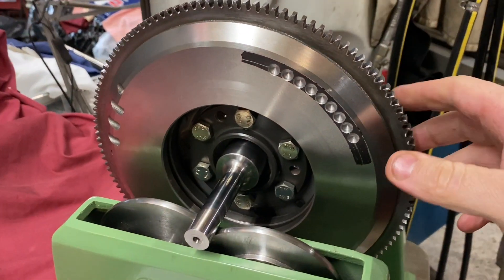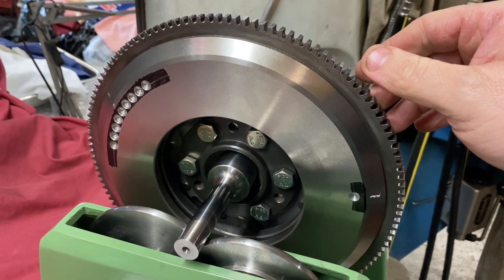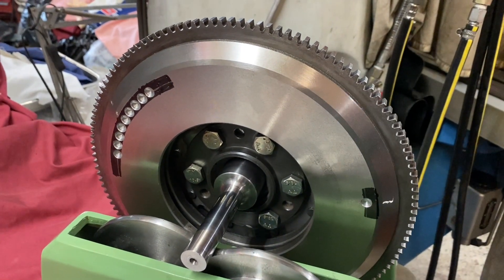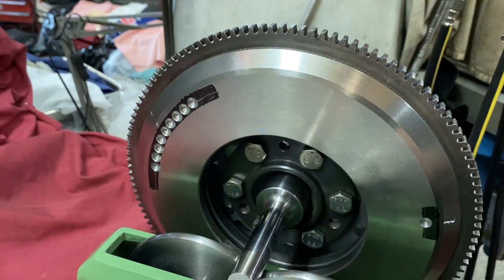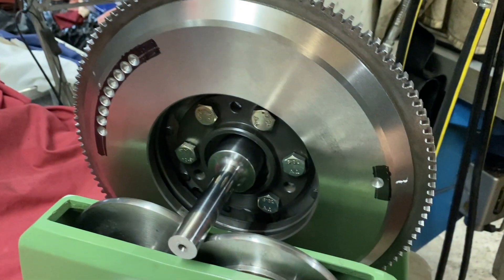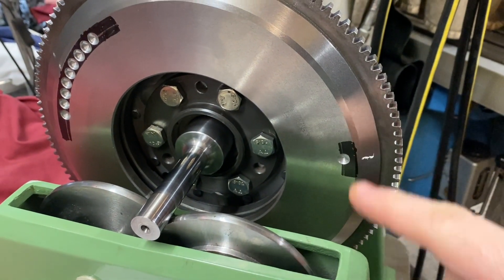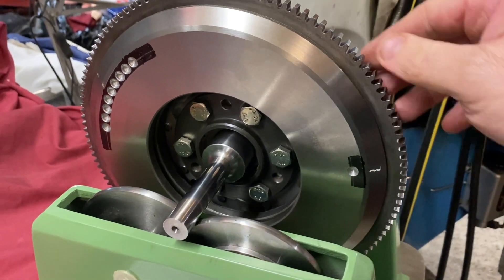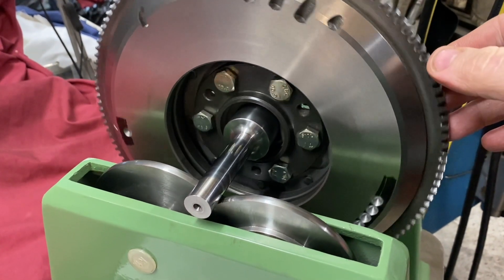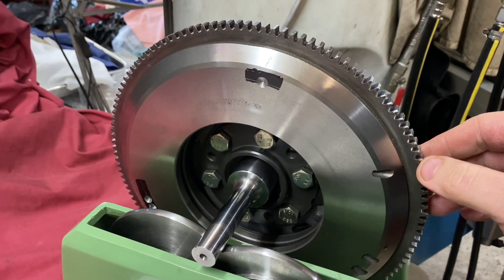We're drilled into balance. This is a good example to show you what happens when you just over drill — as you can see, I've got the holes here to get it in and actually that's a little bit too much. So I just had to drill an extra one in the new heavy spot, which was just a tiny check to bring it back into balance. But as you can see, that is now happy.